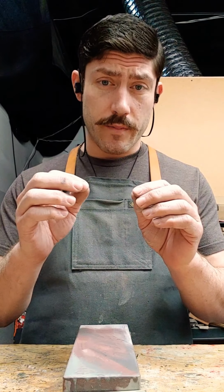Now, what I like to do for my own personal use is I'll go up to 3,000. So for me, it's easy. If I start with 1,000, develop a burr, then 3,000, and all I'm doing is a light polish, I might do less than 10 strokes a side because I'm just breaking off that burr with a real fine polish. It's just the very edge, guys. You're not removing a lot of material. So I'm going to make that burr mostly come off, and then I'm going to move right onto leather.